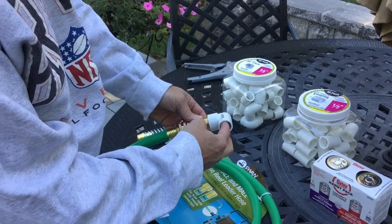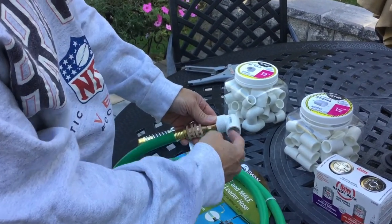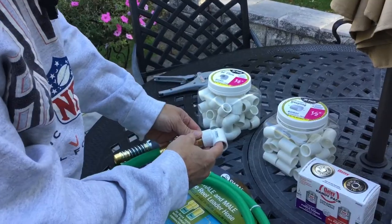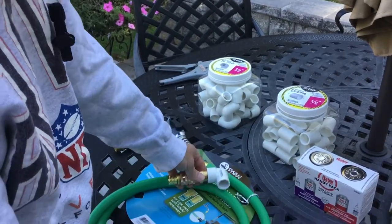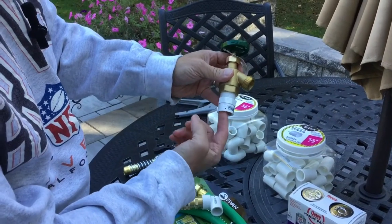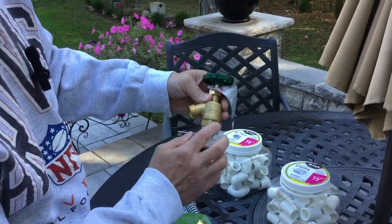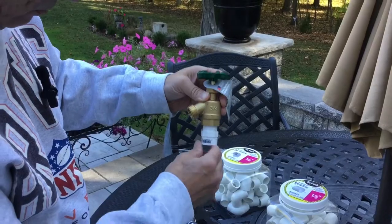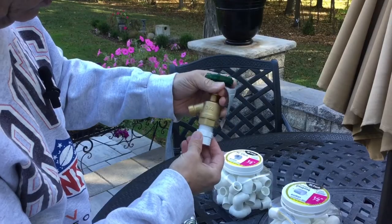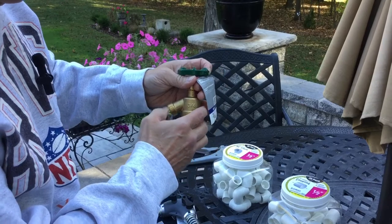The three-quarter inch national pipe thread goes to this female PVC elbow to a slip joint. This slip joint is half inch, so this will be going to a half-inch pipe — the half-inch PVC pipe will just run through the trenches. And then ultimately where it comes out, we'll have these faucets. This is a half-inch slip to a three-quarter inch threaded. The white PVC pipe will come up into the slip joint — it's a three-quarter inch that comes in here. So those are the parts.